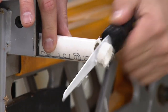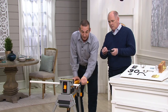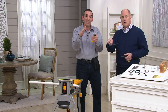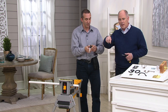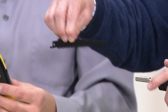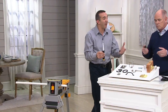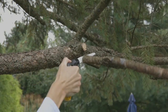These blades are readily available at any big hardware store or big-box store — they come for all the big expensive saws, and these blades would fit those too. It's a perfect, clean cut. If you have a hole in your drywall you may have to clean it out, make it square, and put a piece in. One of the blades is a drywall-specific blade — what makes it different is the point at the end, so it's easy to poke through drywall to cut out a new electrical outlet or fix a hole. Taking blades in and out is super easy — just lock and open.